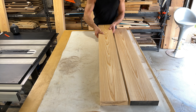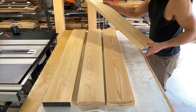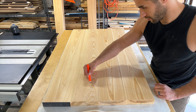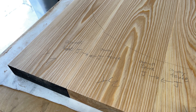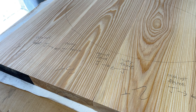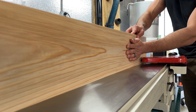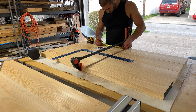Since we use high-quality wood that's been properly dried and jointed, we don't worry about alternating end grain — we just find a grain orientation on the face that's pleasing to us and go with it. Once we do, we number the boards and draw some large shapes on them so we can reference that for alignment later. We also do one additional pass through the jointer where boards meet: alternating the face of one board against the fence while the next passes through away from the fence, which nullifies any deviations from 90° in your jointer and gives you extremely tight joints.